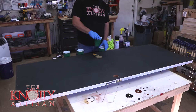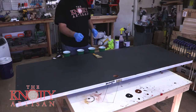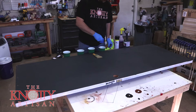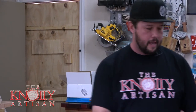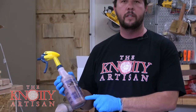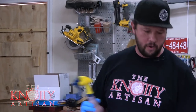I'm gonna go with a technique where we don't actually chop or trowel the surface. I've gone ahead and pre-mixed this epoxy — we're using Stone Coat's regular countertop epoxy. Mixed it really well because we won't be troweling it. It's called a sponge technique; I'm actually gonna use my hands. The colors we've chosen: white, black, cobalt blue, and red glitter. I'm hoping to get some really nice cell effects. At the end I'm gonna spray it with some black spray paint, fog it, and then hit it with some copper metallics and 91% isopropyl alcohol.